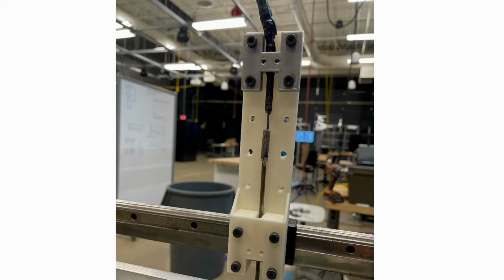A lock rod is normally used for a push motion. However, the team was able to create a design to come from above, converting this linear travel into a pull motion. This pulls on a cable that is then routed back to the encoder to get the total travel of the counterweight. This 3D printed cable holder and guide is attached to a carriage that allows the system to move as needed for different counterweights.